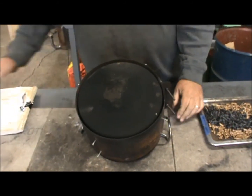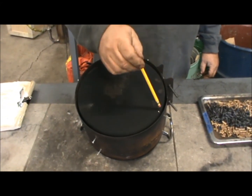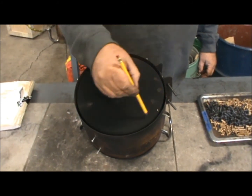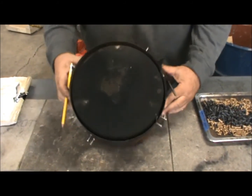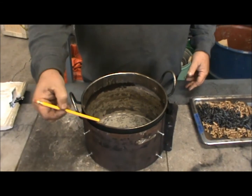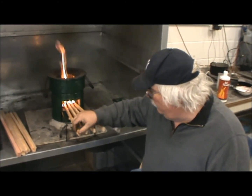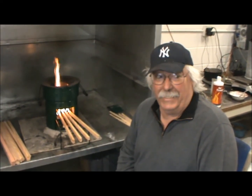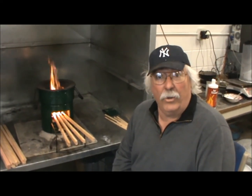This skirt is adjustable so you can change the channel gap. Here you can see a 6mm gap, open at the bottom, with hot gases flowing out the top. Two-and-a-half kilowatts looks like four sticks burning at the same time in this stove. If I put five sticks in there, that gets us closer to three kilowatts, and that's going to lower our thermal efficiency.